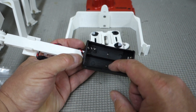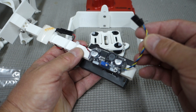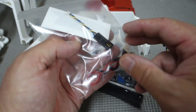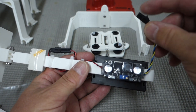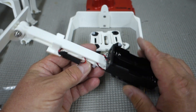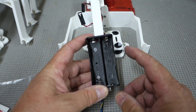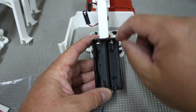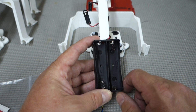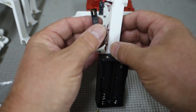You have your power module which takes the voltage from both battery cells. The cells go in here and that turns the power on — this is the live power output to the camera. This little connector lets you pop it together to make the circuit, and disconnect it when you want to leave your cells in the tray without taking them in and out all the time. This is basically your on/off switch. You can leave the battery cells in from field to field — there's plenty of power to get through a whole day of mapping through the solar noon period.